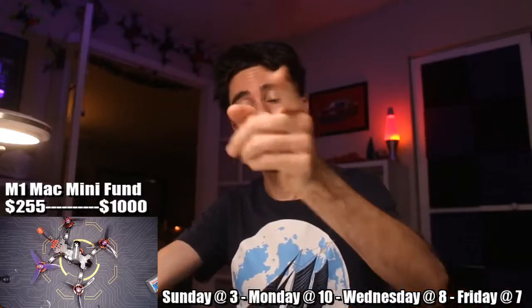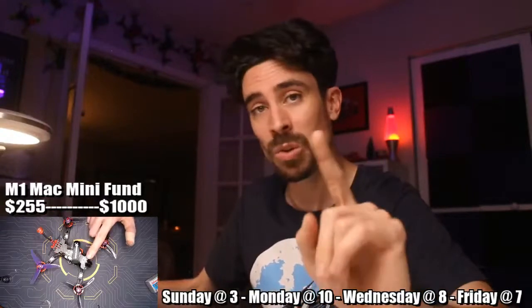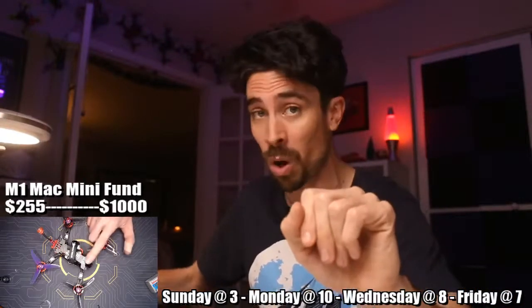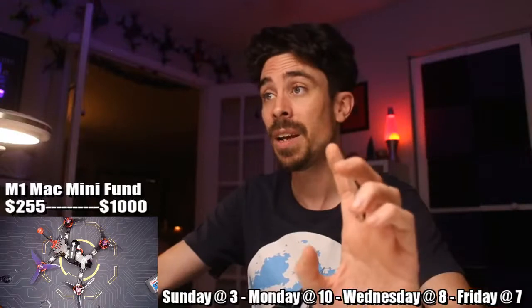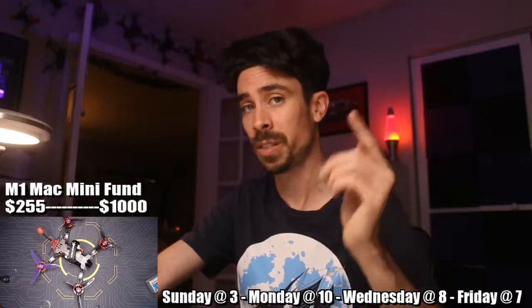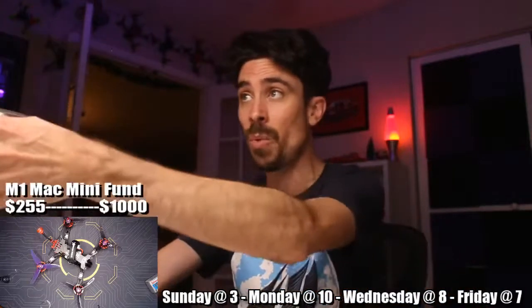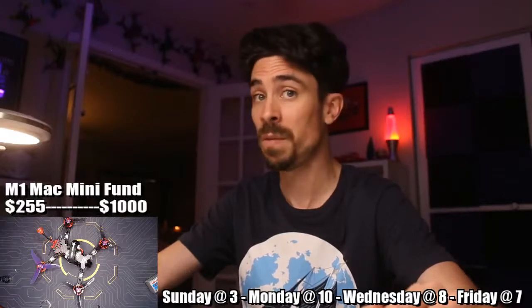There are 4 versions of the Talon MPU 6000 flight controller. This is basically what bit me. There's a version 1 F4, a version 2 F4, and this is a version 1 F4. You can't even find the wiring diagram online anymore for it. And for the F7s, there's a version 1 and a version 2 of the F7 MPU 6000 Talon flight controller. So don't let it bite you in the ass like it did for me. Make sure that you've got the right wiring diagram up for the right version of the Talon flight controller that you've got. The more you know.